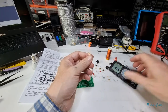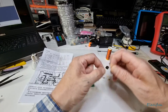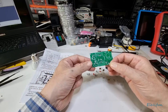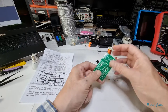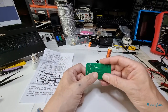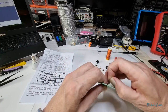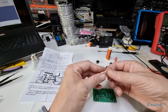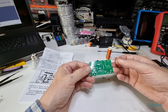Okay, 2K is confirmed. Let's just put these two in first — they're going to be R3 and R5. That's a 2K — boom, we've got R3 here and R5 there. When you bend these resistor leads, just be careful you don't damage the component — but I guess you probably know that anyway.